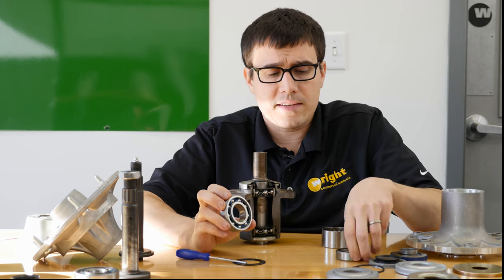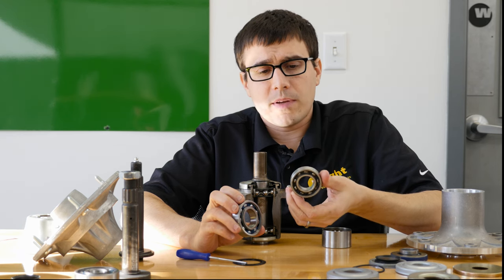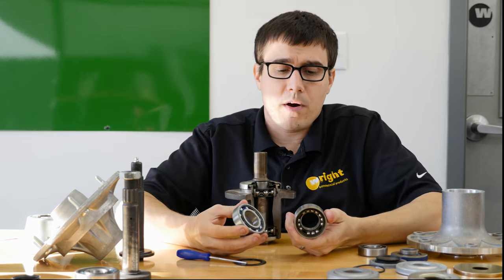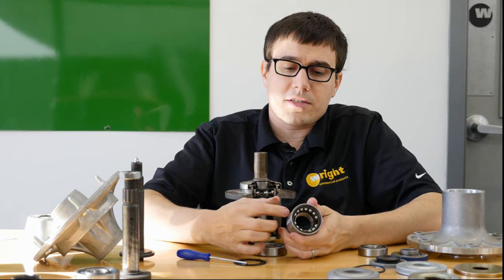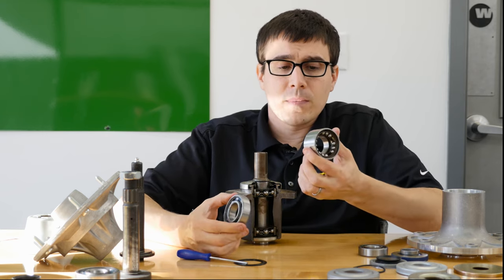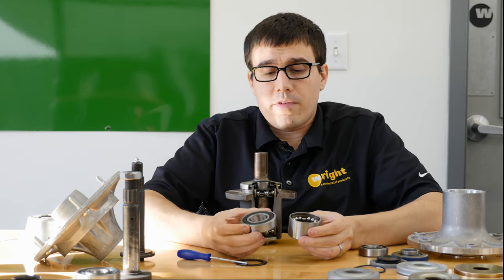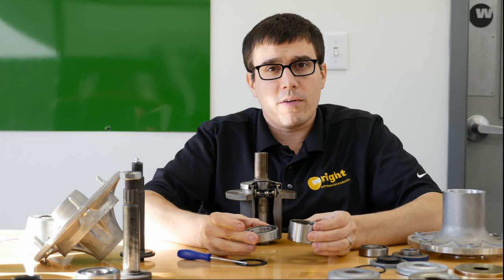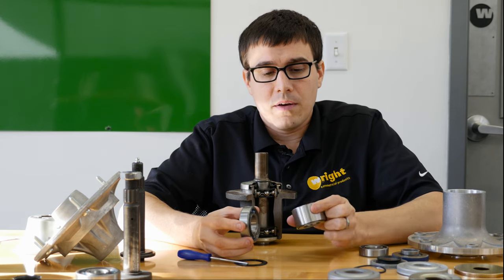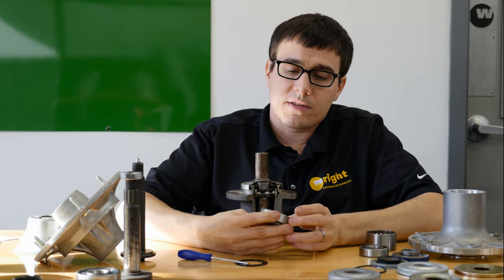This seems to be about an ideal size. This bearing here is from a John Deere commercial mower — it's a little bit smaller, but the balls are also going a little bit slower, so it really just depends on the application. Here we have a double-row bearing from an Exmark. They're sharing the load across two sets of balls, but the balls are much smaller and in a plastic cage. Double-row bearings definitely have some advantage with thrust loads, but they're also very difficult because when you machine the housing, if they're not perfectly aligned, they get pinched up easily. We've gone with our single-row bearing — it's been very, very robust and seems to be about the perfect size for what we're doing.